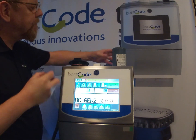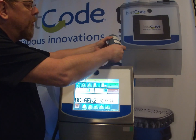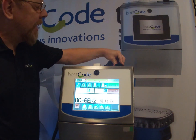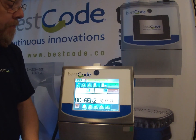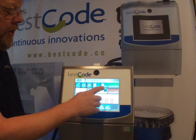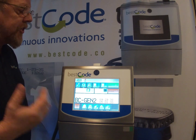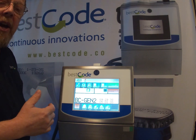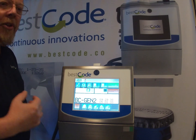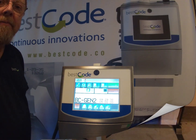Just finishing off now. So when you take this one out, there will be a little bit of a drip. Go ahead and put the cap right on it and dispose of the bottle. Put the cap back on the smart fill cup. And now it's just changed to ink full. So we're ready now to actually go ahead and start up the printer and load all of the ink into the filter, the pre-pump filter, into the pump, into the main filter, through all the solenoids, and through into the print head. So we'll go ahead and start that process now.